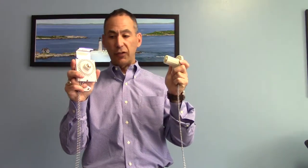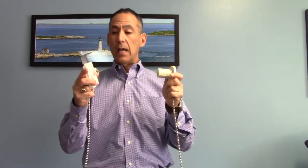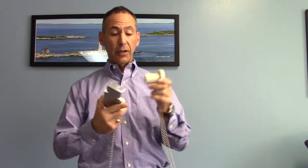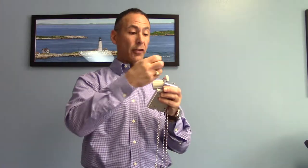This is what I have on the Mecco clutch side, and this is the Rollies clutch side, and you can see that they're very different. The Mecco has the clutch system and the bracket integrated into one, so when you mount it, you mount the clutch with the bracket and it gets installed as one piece. When you're doing the Rollies part, you're installing the bracket and the bracket gets installed and then you feed this into the bracket.